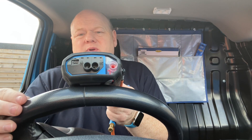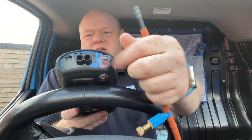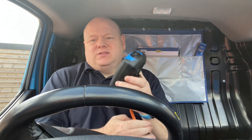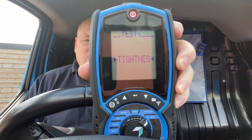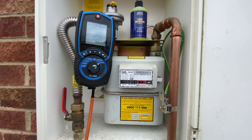You have to be a little bit careful here because people put it in the wrong holes. When you're looking at pressure you're normally looking at P1 and T1 — that just goes in the bottom. Obviously check your holes to make sure there are no leaks, and then we're putting it into tightness test mode. You can scroll down and change it, but for this we just want it on tightness test.